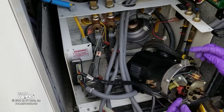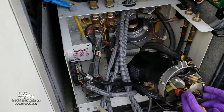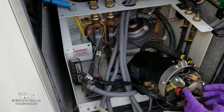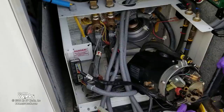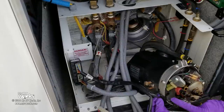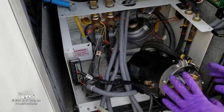So to get to this point we took off two bolts, here are the two ears — be careful, they will break. If you do a lot of AquaHot repairs and services, I stock a new reflector — less than $30. If somebody's worked on it before and it's bent, that's not going to work. Sometimes these things are so nasty you can't clean them and you'd waste an hour trying. I also stock nozzles and these little grommets — left and right, top and bottom. Fuel filters too. These are things I stock in my trailer for AquaHot calls.